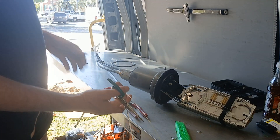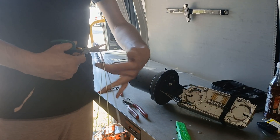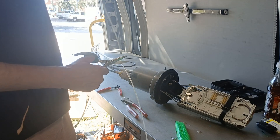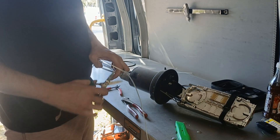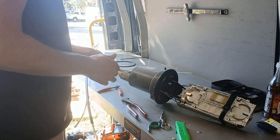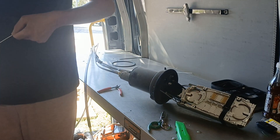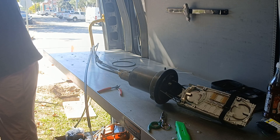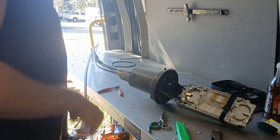With these strength members, here's a little fun trick — you can't really cut these things with your scissors, or you can if you really, really push. But if you just bend them ever so slightly, they give up right away, which is pretty cool. Then for my own sanity I cut them into about three-foot sections and just put them in my trash can. I rolled one up one day and had an explosion using electrical tape, and it wasn't fun.